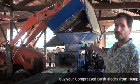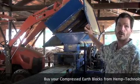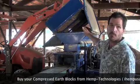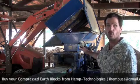This is the compressed-earth machine here. What this does is take our soil in any form — meaning it's been stabilized or not stabilized — it goes into the hopper and it is pressed hydraulically into a brick.